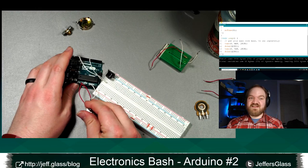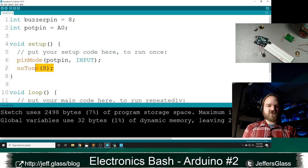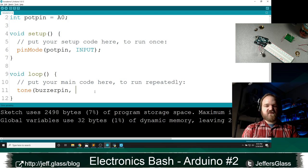So coming over to our code, first, I'm going to define where our pot is plugged in on A0, and then I'm going to set it up as an input with the pin mode function. I forgot I defined buzzer pin up here, so I didn't need to use 8. Well, naughty Jeff. So here's what I'm going to do. In my loop, I'm going to say tone on my buzzer pin. And then I'm going to, let's just start with the value of the pot pin proper. And then we will have that play for,